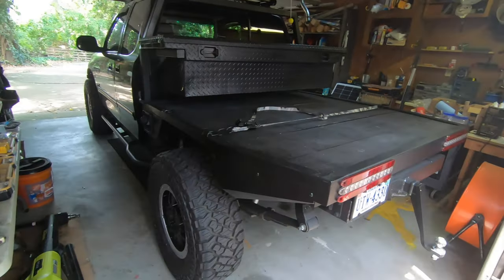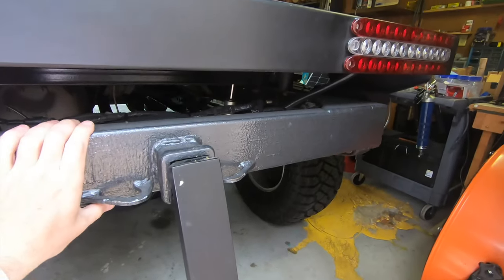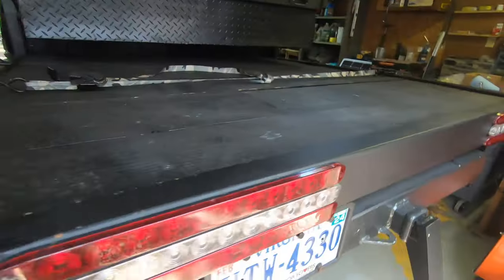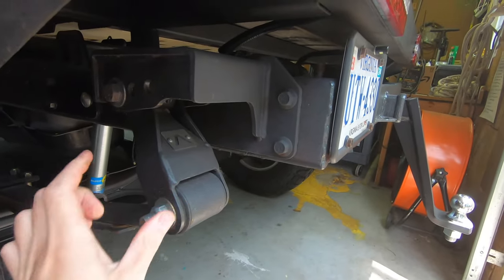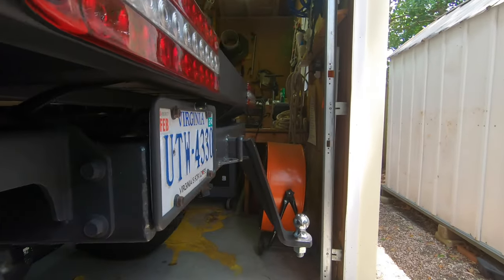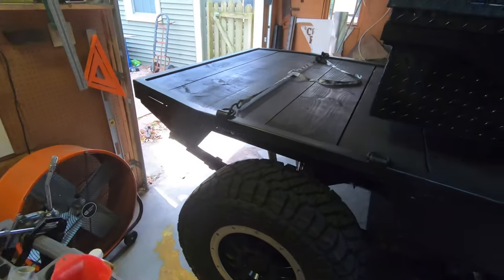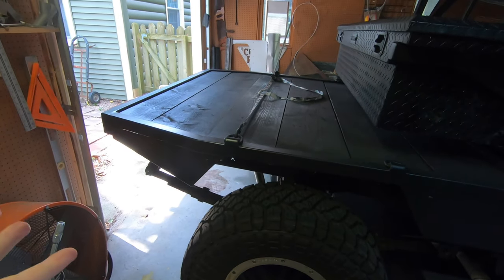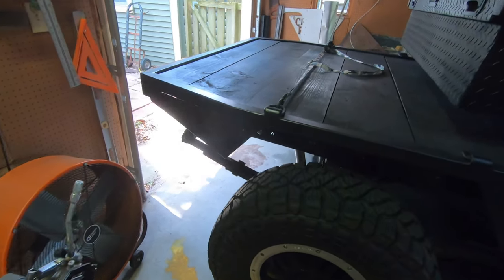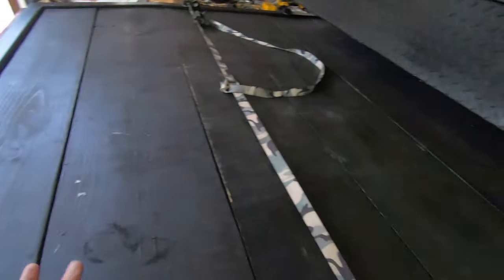The entire truck is 14 inches shorter than a stock Tundra. I shortened the frame and added a cross member after cutting it off to build a receiver hitch. It was cut off directly behind the rearmost part of the shackle hangers, primarily for departure angle. The flatbed is built to almost the same length as the body, just sitting out slightly longer, so I have barely any overhang behind the rear tires. With the spare tire removed and the frame chopped, everything sits much higher — the only thing I ever hit on departure are the bottoms of the leaf springs.